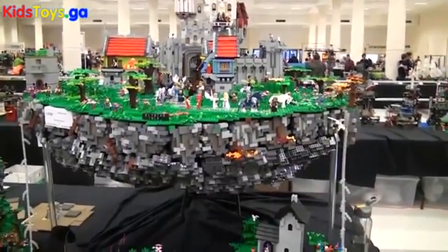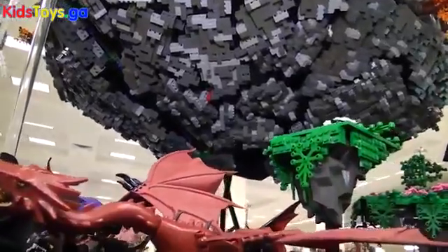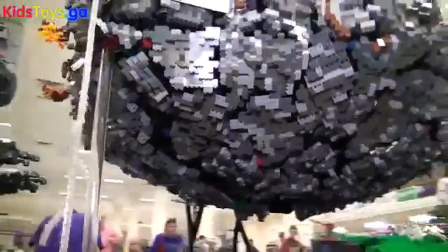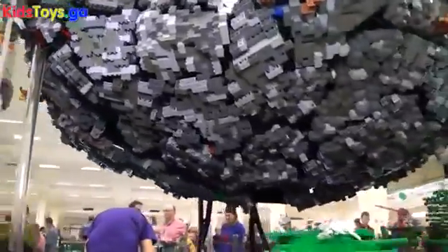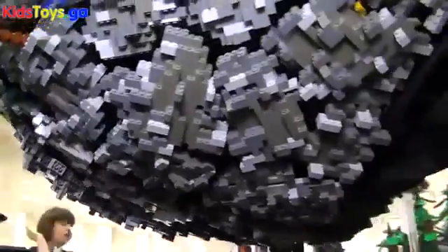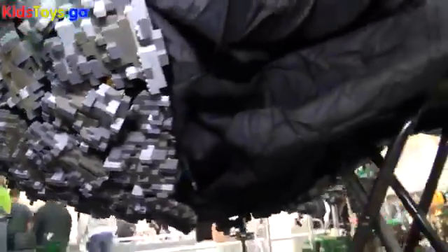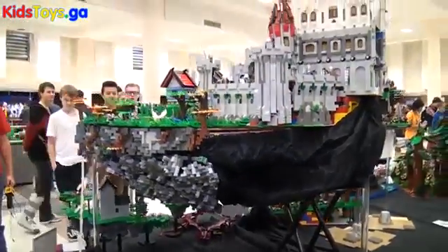Can you talk a little bit more about what the structure is like on the bottom — you've got all these different rock sections, how is that all held together? Each of these rock sections is sort of independent and they hang from a framework that's hanging from three points. It's a triangular truss, and there are four of these sections underneath. So all these rocks are just hanging from that, which is then hanging from the main framework, which is suspended from the base.